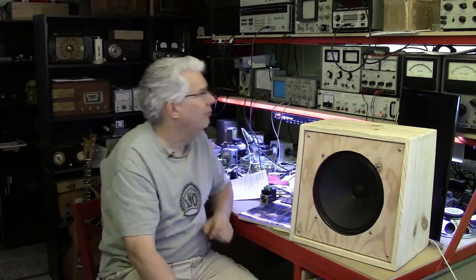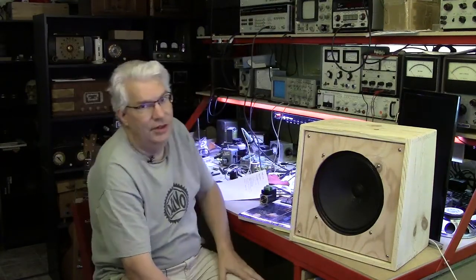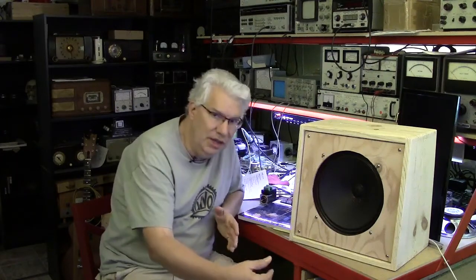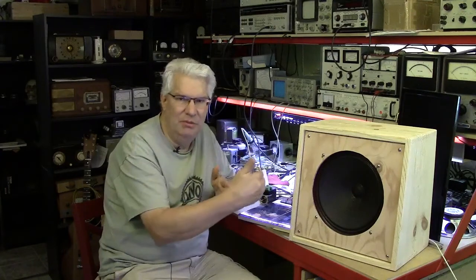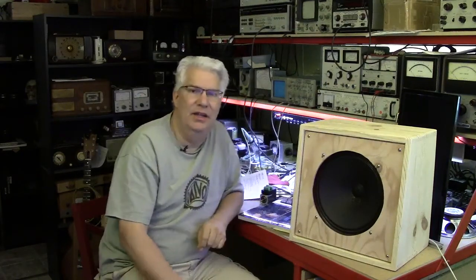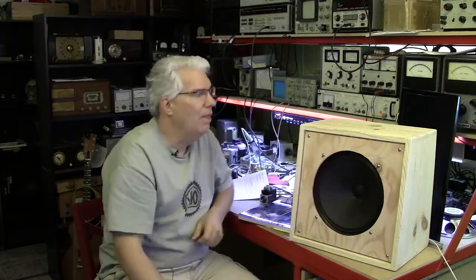And also up along here, you can't see it, but I have a Sennheiser E609 microphone to mic all these speakers. So when we do A, B, C, D, E comparisons, we can have proper placement, proper distance, that type of thing, and look at SPL levels, frequency response, tonal characteristics, those kinds of things. And it's on one of those magnetic indicator mounts, so I can easily move it to the next speaker.